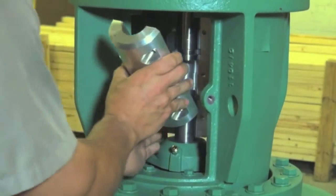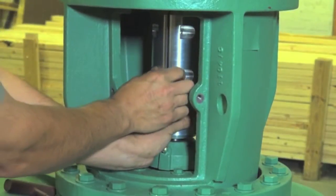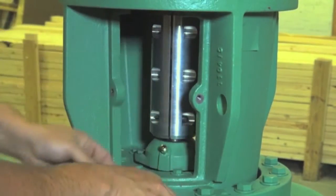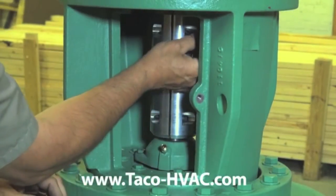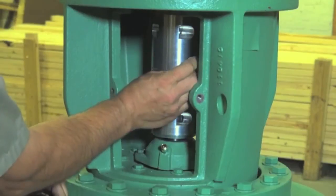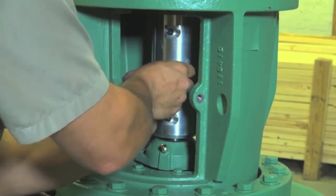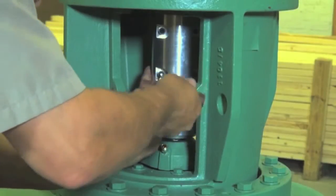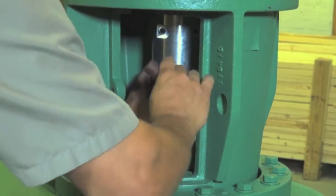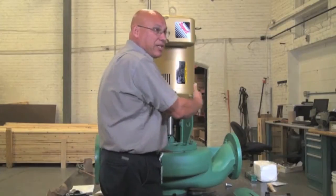Grab your other half, making sure that you've got an equal gap on both sides — make them both even. The way you do that is put three screws on one side, then three screws on the opposite side going the opposite way so that it's balanced. Bolt it up. It's very important that the pump spins really free and the gap on both sides is the same size, achieved by tightening the bolts evenly.